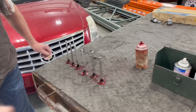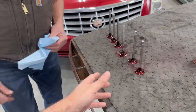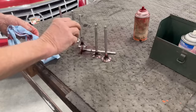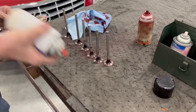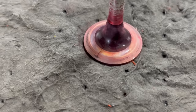We're doing a dye penetrant test here. You spray the dye on whatever you're checking for cracks, let it sit for a few minutes so it pulls down into any cracks, then wipe it clean on the surface. The valves have been engraved with little numbers on top so we can tell which cylinders they came out of. Then the developer — a white powder — is sprayed on to attract the color back up out of any cracks. Wow, that makes it easy to see.